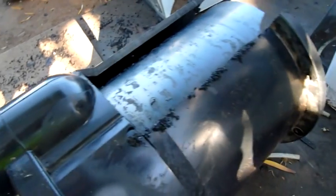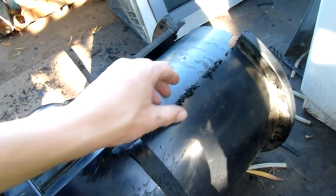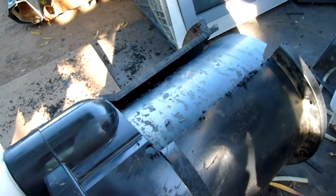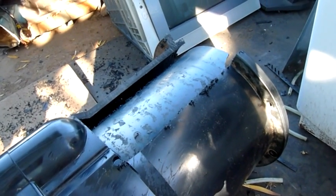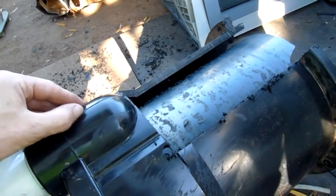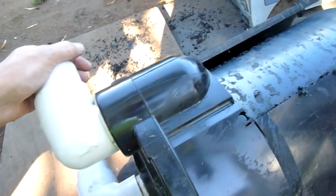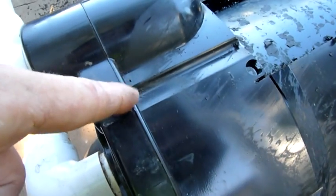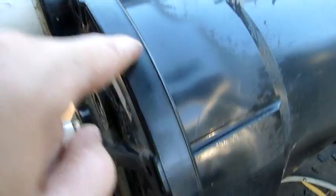So there are several things at play here. The way that crack has radiused, nice rounded edges along it tells me it's partially a cold flow that's opened up, also helped by chemical attack from the plasticiser. It's an unfortunate set of circumstances — otherwise this unit would have been running today. It's been replaced with a large $12,500 Chinese unit with a big radial four-cylinder Danfoss compressor, a large 250-litre stainless steel built-in tank, built-in pump — an all-in-one sealed contained unit. So we've replaced that and a carrier unit with it. It's an excellent unit.